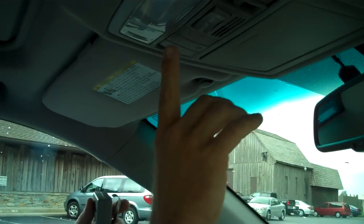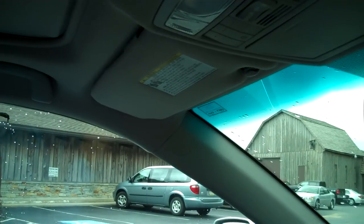So once you do that — whether it automatically takes with just the remote or you have to hit the learn switch — that's how you're going to program your garage door. From that point, you can program up to three different garage doors. Just grab the remote for each garage door and repeat steps two and possibly even three.